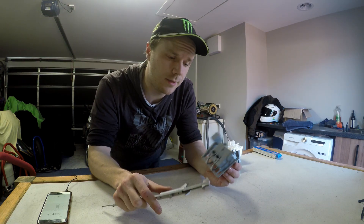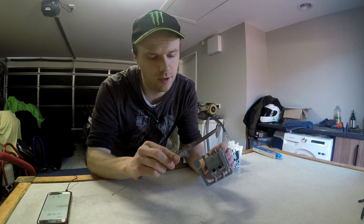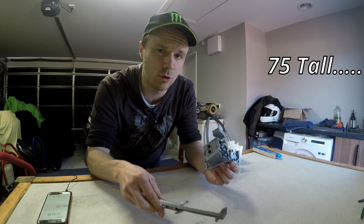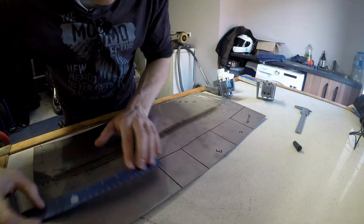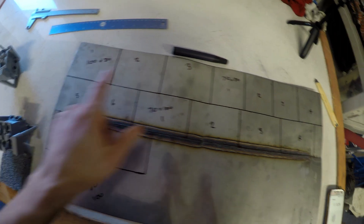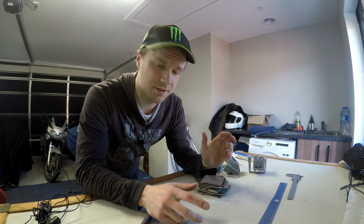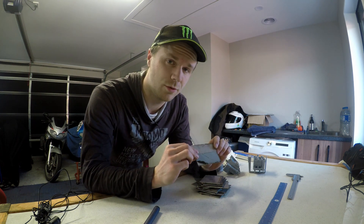Now that we've got these glued together we need to make some boxes to put them in, roughly about 80 by 100 and about 70 tall. This sheet is from my mate's scrap bin and it's 1.5mm stainless steel. We've got all 15 panels marked out which should make three boxes with no lids, so let's get to cutting and then weld them together. We've got our stack of 15 bits of plate and they've all got super sharp edges.